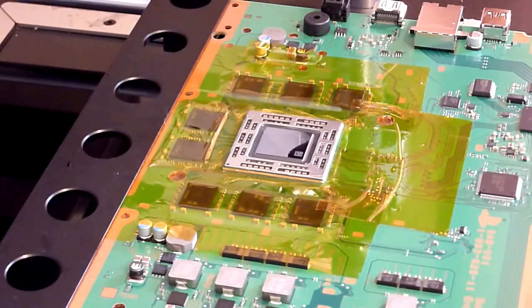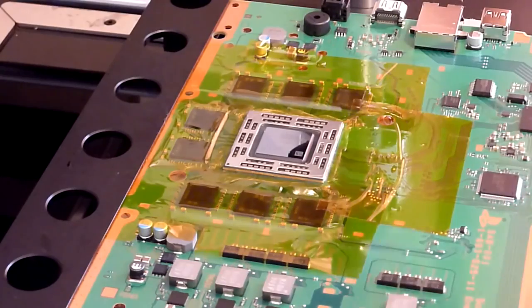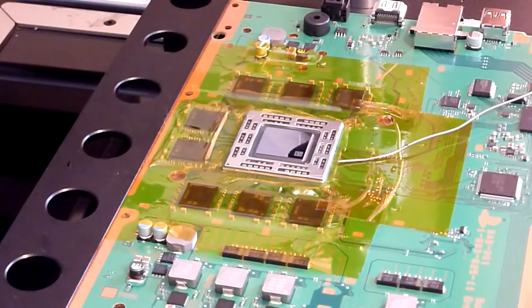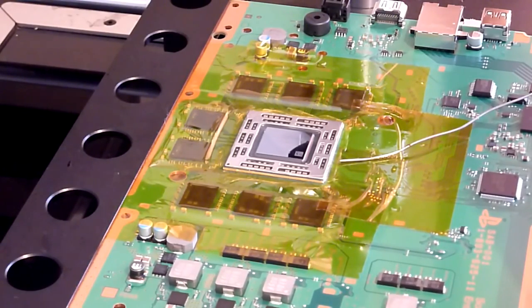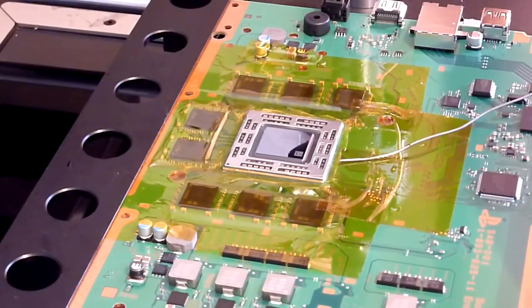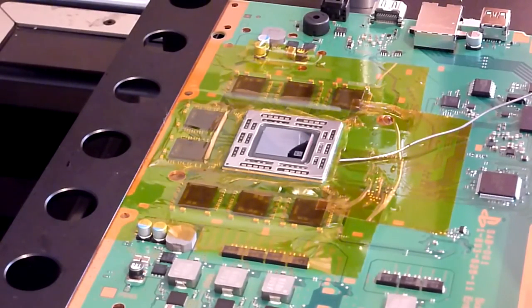What will happen now is we need to place our top temperature probe in position. We have a fixed metal wand, if you like, on this particular rework machine, and that wants to go contacting the board a couple of millimeters away from the site we're working on. So that's there, and what we need to do now is get some fume extraction and put it close to the site we're working so it can draw all the noxious fumes away, because this stuff is pretty nasty. You don't want to be breathing it in. So I can't stress enough that you make sure you have sufficient ventilation for this. You don't want to be doing it in a closed room. You want plenty of air and ventilation around it.